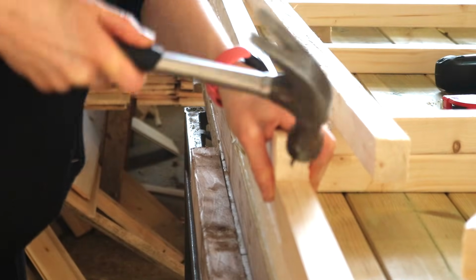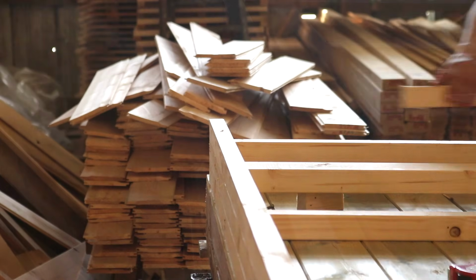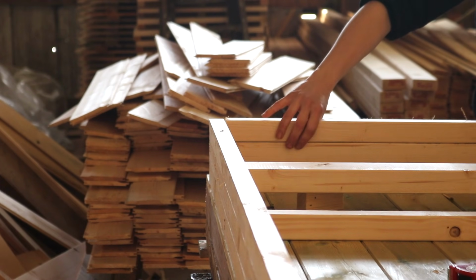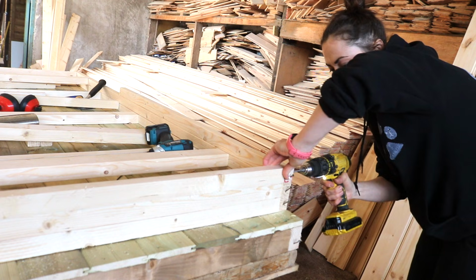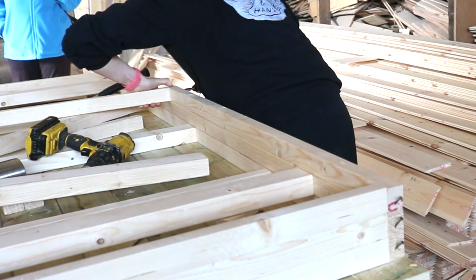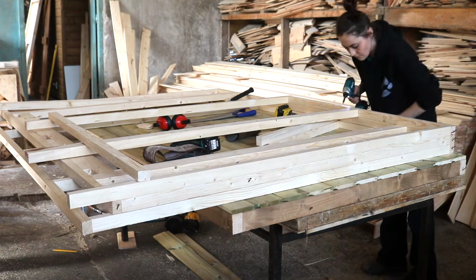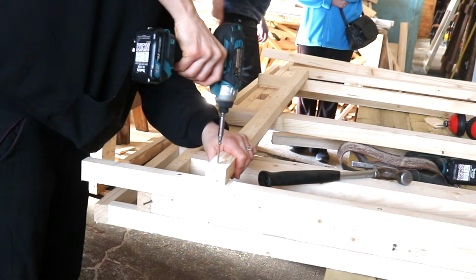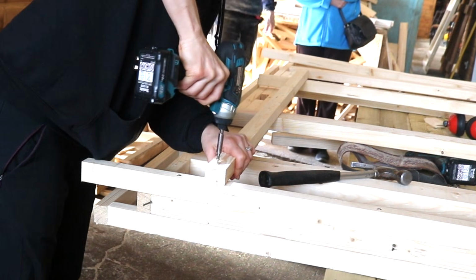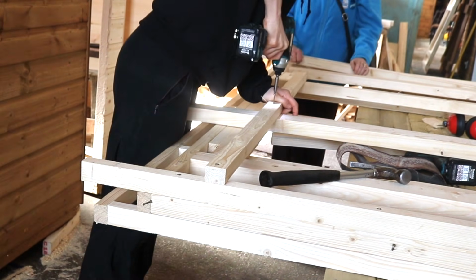Again, nailing down the bottom panel first along with the other panel's bottom one, but with it being a slope, I'm screwing two longer than I needed spars either side. So it gives me space to cut them down in a minute to match the shortest and the tallest point of the front and back panels. But to keep those spars still and work out where to cut them, I also temporarily screwed the bottom batten of the last panel that I needed to make across the upper part of all three of those spars.